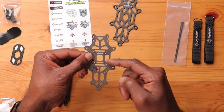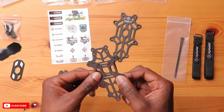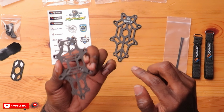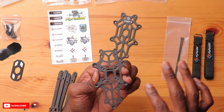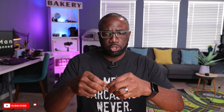We're going to use our bottom and mid plate — the sandwich plate — and try to get this thing lined up. Make sure you have your threads facing up; these are going to hold your actual bolts to secure the flight controller to the frame. Most of the top and bottom plates have countersunk holes here, which is good because typically most frames use a regular bolt that puts pressure on a specific point. With countersunk holes, it's going to be flush and also distributes pressure more evenly across the plate.